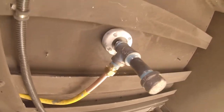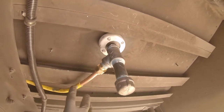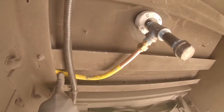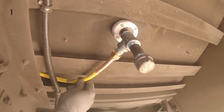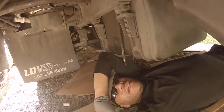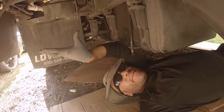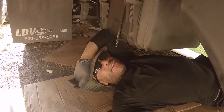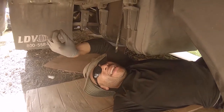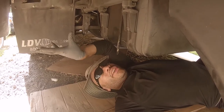And this is the final connection back here. This is where the hot water heater is, right here. And just like I said, make sure nothing is making contact. It has some give, some free play. And when you are using half inch copper lines, it doesn't bend as easy as 3/8 or smaller. So you just have to be mindful of that when you're doing your bends, like your 90 degrees, because you can kink that. And if you kink that, you're going to have to replace it because it's not allowing the gas to flow. So keep that in mind.